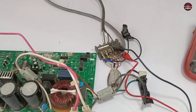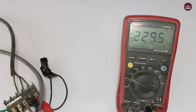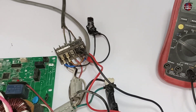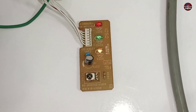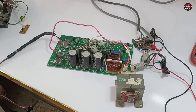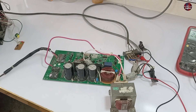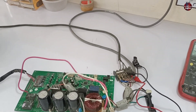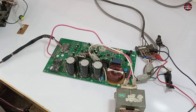The communication circuit of the indoor could also go bad — this fault is also possible. In my case, electricity is flowing in the outdoor unit; as you can see on the multimeter, 220 volts are flowing. But the error code is still shown on the indoor display, which means the outdoor motherboard is bad and this is why the problem is shown. If electricity is passing through both motherboards, then the communication wire could be another reason for the fault.